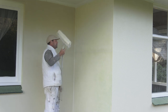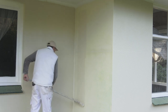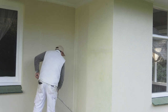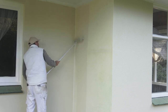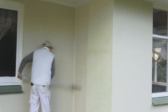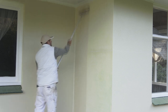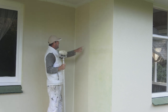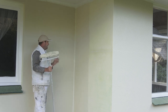Painting the walls is the same as painting any other wall. I'll start from the corner, work up and back down away from the corner slightly. With cement render it will take a lot more paint than plasterboard, so you won't go as far with each dip of the roller. The idea is to force the paint as best you can into the wall, because there are lots of little hollow sections, like pinholes everywhere, so you'll need to force the paint into all the pinholes.